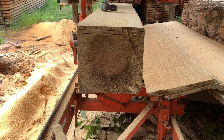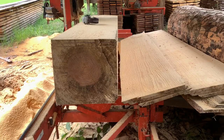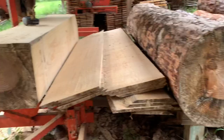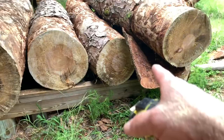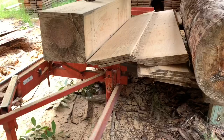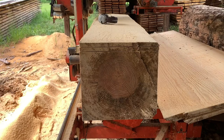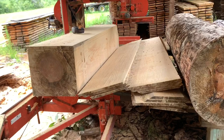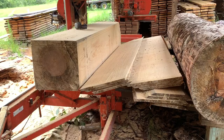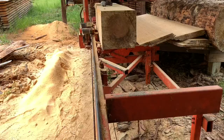Let me tell you something, folks - when you're doing board and batten on the side of a barn or a house and you're covering up 20 inches every time you slap one of them boards up, then put a three-inch bat over the crack and keep going, it don't take long - you've wrapped around something big. That one will cut a 20, and that one will probably clear up at 14. Then it's going to be 12s and 12s. I was crowding her pretty good with that dull blade - 20 inches wide on that old growth tight-grain pine is hard. The little 18-horse Briggs had its tongue hanging out. But I'm fixing to put a new blade in there and get her cut on up.